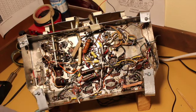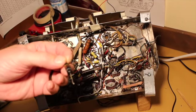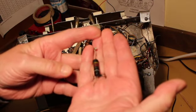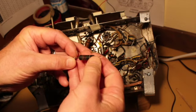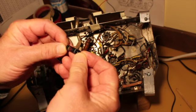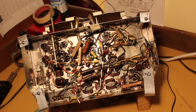What I am finding is that these more modern — if you'll pardon the expression — black caps like this guy are pretty bad too. This one is leaky as all get out. So even though they're wrapped in what looks like nice plastic doesn't mean they're not bad. This one and several others I imagine have to be pulled out.